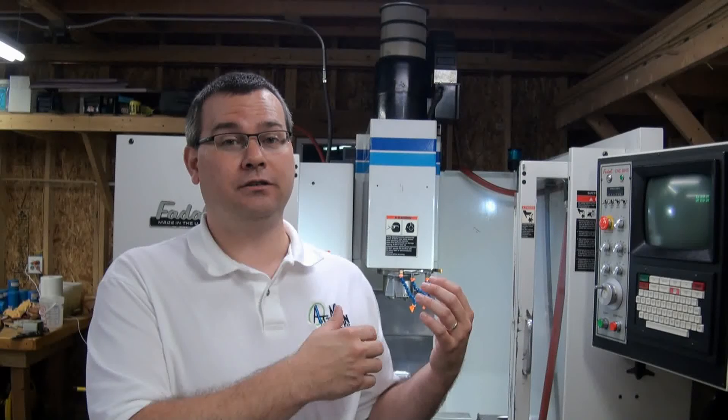That can be good or bad. If you're learning CNC machining and programming, being able to catch a machine that runs at only 100 inches a minute is very good. If you make a mistake in your program on this machine at 400 inches a minute, it's probably going to crash into your part before you even realize what happened. So having a personal CNC machine that moves a little bit slower is a good thing if you're learning. On the other hand, if you're going to make a lot of parts and need to make them fast, you're going to want a vertical machining center.